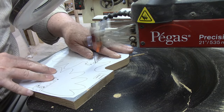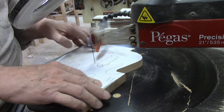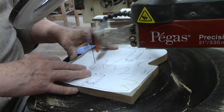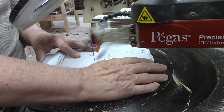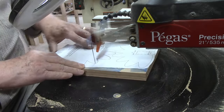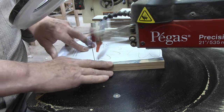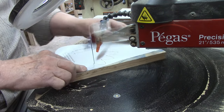The best way to handle the slot for the feathers will be to go past it and come back to it later. The line soon went vertical for the turkey's tail feathers, and the next part is going to take some skill. The way to make these turnarounds at the bottom of each semicircle is to cut right up to the point, then back off pressure on the blade slightly so it is no longer cutting, then slowly pivot the workpiece until it's facing in the new direction you want to cut, and feed it into the blade once again. By doing it this way you should have a nice sharp point at the turn. I kept repeating this procedure all the way around the tail feather portion of the turkey. If you're new to scroll sawing and find this difficult, you could instead cut rounded edges at the bottom of each semicircle — it will look just as good. But if you want to progress at this craft, making sharp interior points like this is a skill you will need to develop.